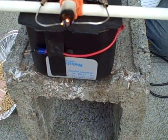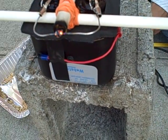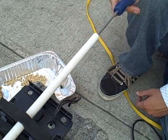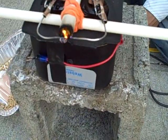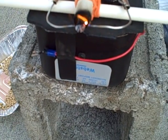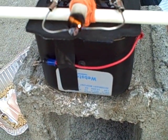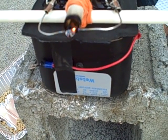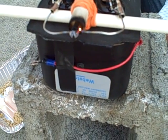So the spark is only jumping between the two wires. We're slowly feeding wood pellets in the other end of the tube. Our trusty assistant is pushing them through slowly with a screwdriver. We're just seeing how well this gasifies. You can see the flames coming off — it's definitely making gas and those vapors are burning. You can also see it's charring the carbon and leaving biochar at the end.